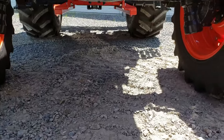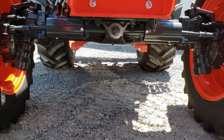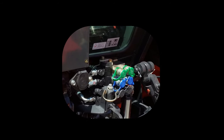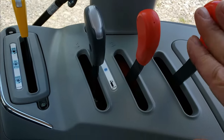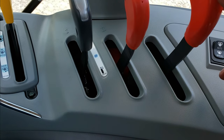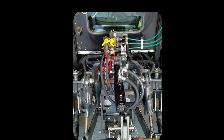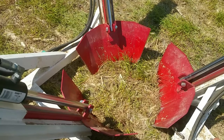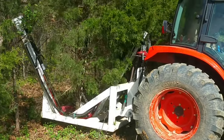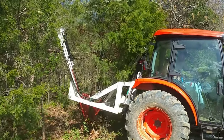I set up my tractor in a very specific way. I made sure I got ag tires and loaded them with Rim Guard for extra traction and power. I added either one or two rear SCVs for a total of three — it's nice to have three SCVs; I've used them all at one time before, depending on what implement you have. Also, if you have a top link or a tilt link you're going to need rear SCVs. I also made sure that one of the three SCVs had a detent on it, which basically locks open the hydraulic flow for implements like log splitters and tree spades that need a constant hydraulic flow.